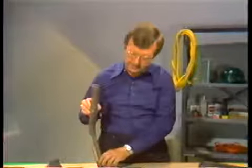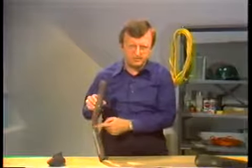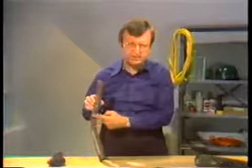When you inspect the tubes, you have to be aware of the amount of tube thinning that can be tolerated before repairs are necessary. Now, to some extent, tube thinning can be determined by looking at and feeling the tubes. You can tell that local thinning caused by erosion has occurred because you can see and feel a gouge in the affected tubes. Erosion can happen wherever there is any flow across a boiler component.